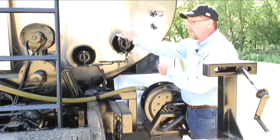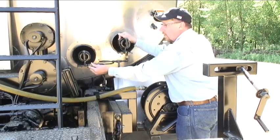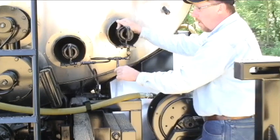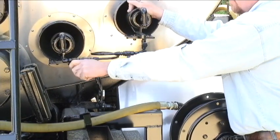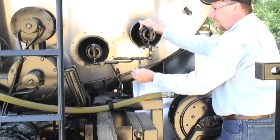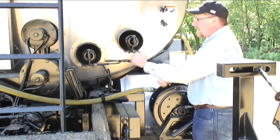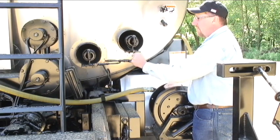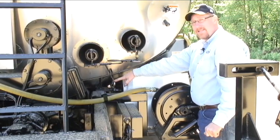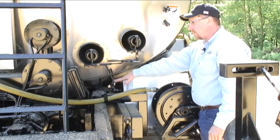You open your dampers as we explained. You open your LP tank. You can come back here and with this valve completely closed — or clockwise — have this valve set also and this one closed. Once you open the LP tank, we can then light this burner and it'll give you a pilot flame. To make it a warmer or hotter flame, you can open this valve. If you need to use the upper burner, you turn this valve on, light it, and then you can open the flame by using this thumb valve also. We set the pressure regulator on our LP system around 20 PSI, depending on the tank size. Larger tanks may take a little more PSI, but normally about 20 PSI is what we set that at.